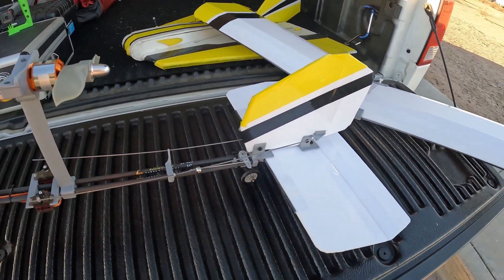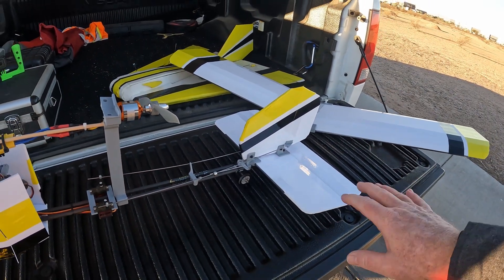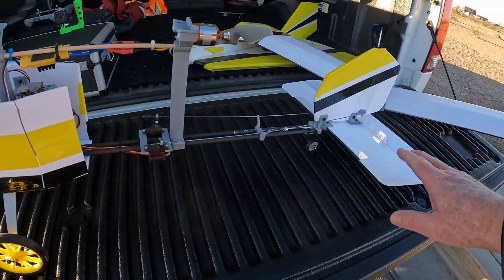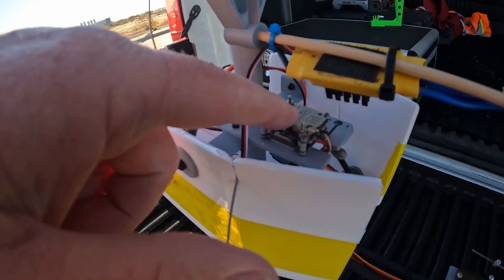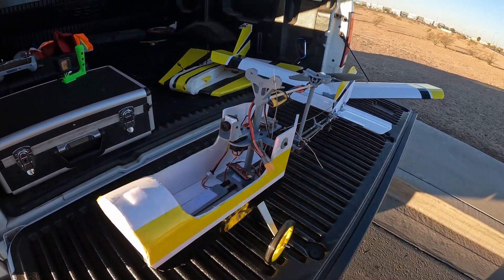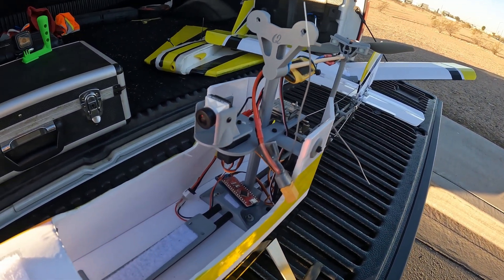Another difference from the slow stick is that I've designed the tail to be on top of the carbon arrows rather than below, because the tail wheel and landing gear are already pretty low to the ground — I didn't want to lower it even further. It also has the Vista mount, which bolts onto the center strut and puts the camera right where I want it. This is my custom OSD — an Arduino giving me altitude and battery pack voltage.